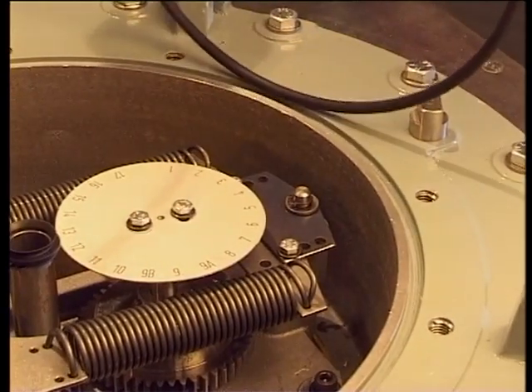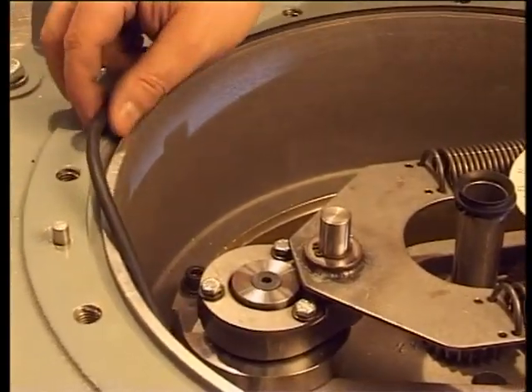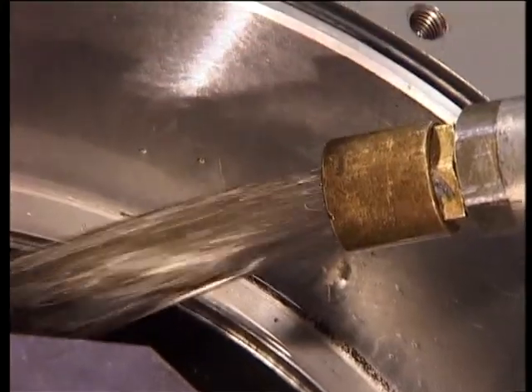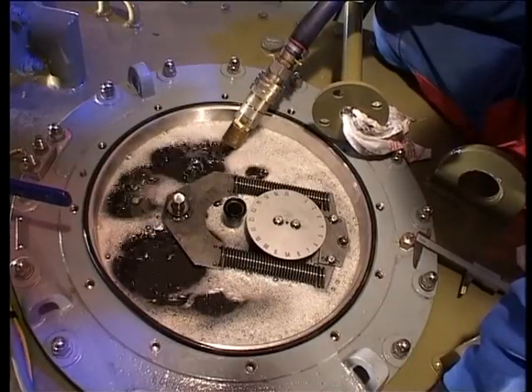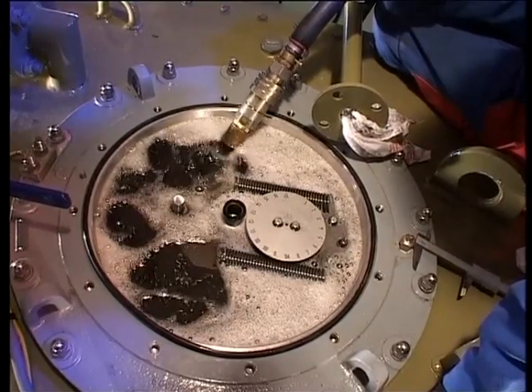Change the cover O-ring. Place it in the groove. When the tap changer is clean and dry, you can fill it with approved oil which must be filtered as you fill. Fill to the level of the spring package in the mechanism.